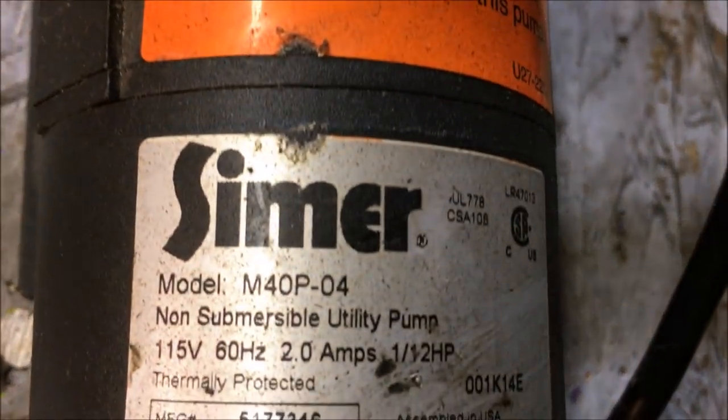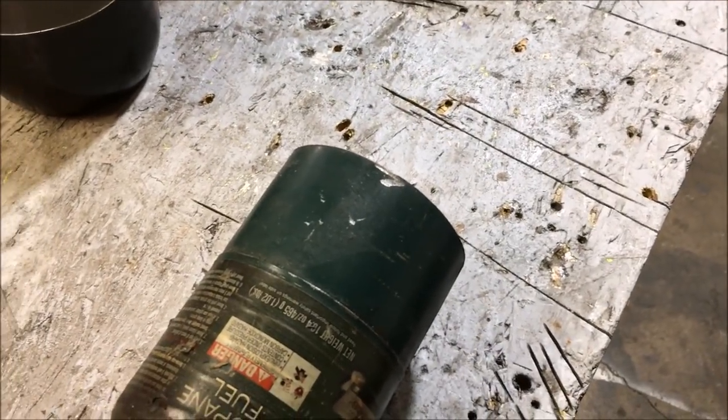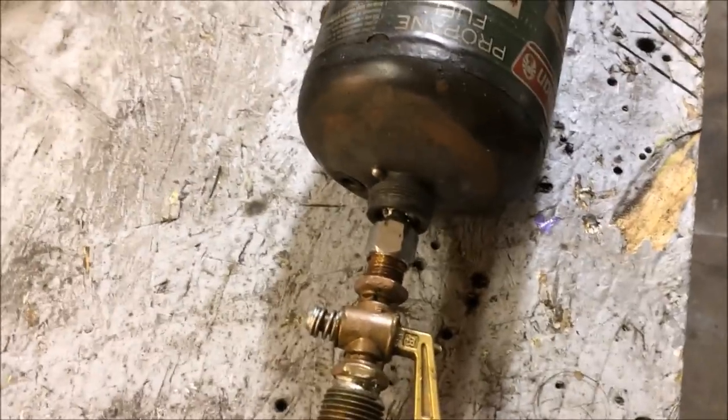That pump was just not effective for waste oil burners and it can't pump water at high pressure. On waste oil burners I've also used the drip feed method, which is effective but has limitations - it produces a pulsating burn. If you have a high-power system with a lot of pressure this just can't do it. It can only run on very low-pressure combustion chambers, so it's good for small burns or heating applications, but not for forges.